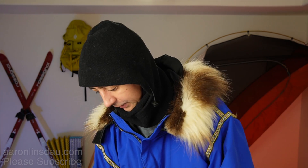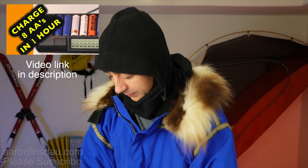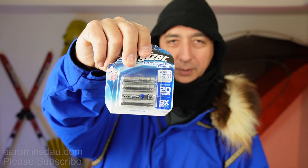The way lithium polymer batteries work — and just about any other type of battery, including nickel metal hydrides — is that once you use them in the cold, they lose a proportionate amount of charge. If you have this much charge and they lose this much in the cold, when they warm up, theoretically they come back up in proportion — but they don't. That is the annoying thing. Lithium primary batteries generally recover well, but lithium polymer batteries in the cold do not proportionally recover. They may come back at maybe 80 or 90% — super irritating.